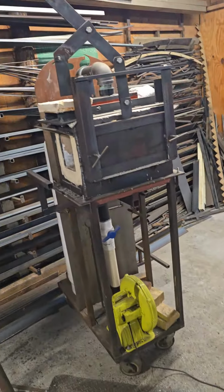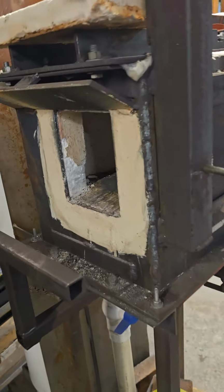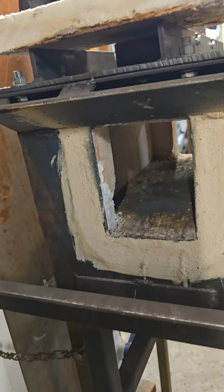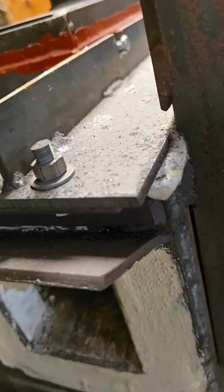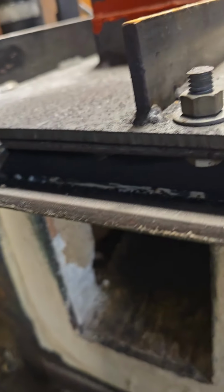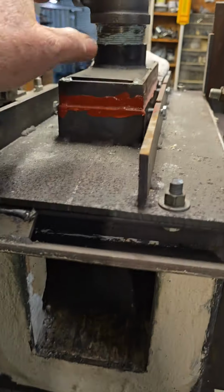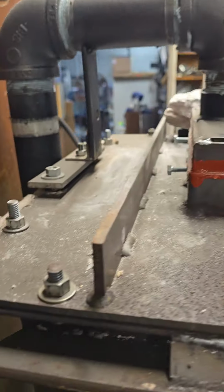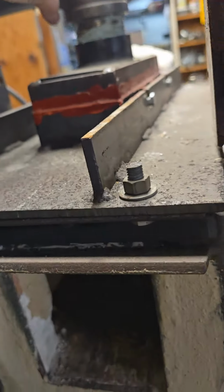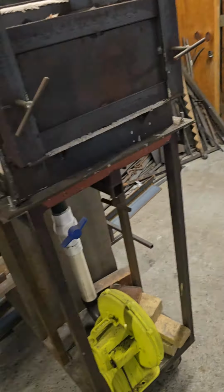I do a lot of forging. This is my homemade propane forge that I use. I built it. I can rebuild it totally off stuff out of Amazon. Got the air handle. The only thing I really bought from somebody, a guy by the name of Mark up in Franklin sells these ribbon burners, and I went ahead and bought that ribbon burner from him because he casts them in refractory and they're really good. I did buy that. Then I just bought off the shelf pipe parts for that because this uses forced air.